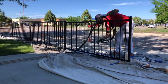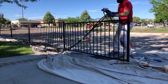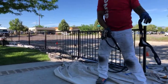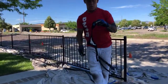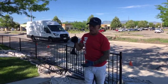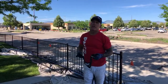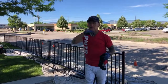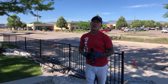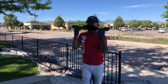Do you have a Ford cup ratio? I didn't. I brought my Ford cup out here, but I didn't thin the product. It says you can thin it up to 1.5 times with acetone. I brought a Ford cup, but I didn't actually test how thin it was, because I just poured it right in and started spraying with it. It's sprayed straight out of the can. So I don't have the ratio because I didn't thin it.